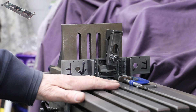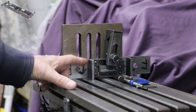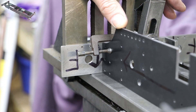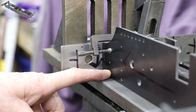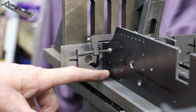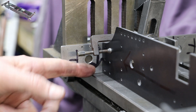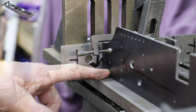What I do now is put the frame on the table, probably move the camera around so you can get a better view, and then clamp the frame to the bracket and mark it through with the drill. I've had to reposition the whole setup in the milling table because I wasn't able to get the drill in - obvious with hindsight - and even now I'm only going to get access to the two holes that are further back. I'll have to make a little tool to get to the other ones, which I'll do after I've marked the first two.